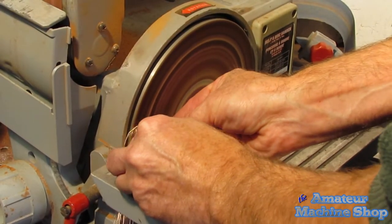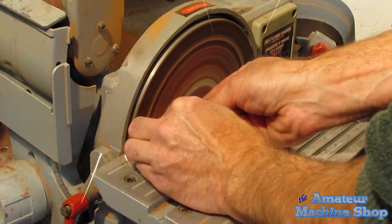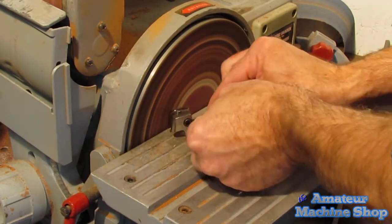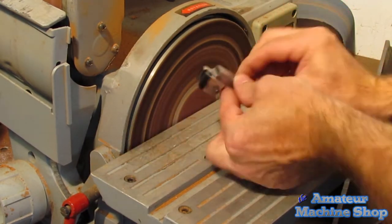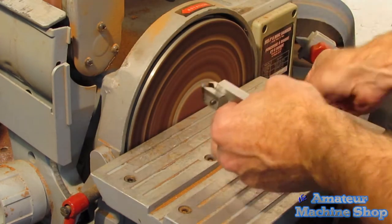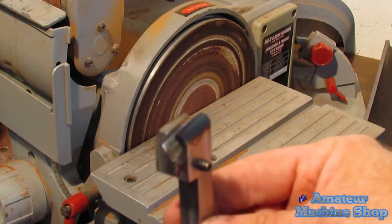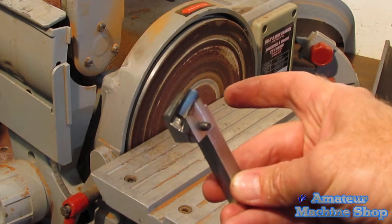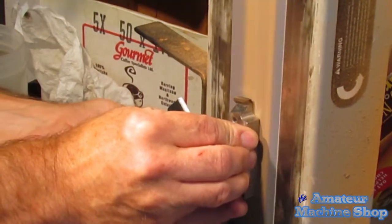For the side chamfers on the tool and clamp, I decided to just grind them. The chamfers are clearance and not critical, so I didn't spend the time setting up to mill the chamfers. Chances are I will regrind them to fit a future machining application. I am using a 4x36 inch belt grinder combo, using a fine grit sanding belt for steel. I try to grind out the tool marks. It'd be much easier if I had a surface grinder.